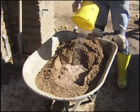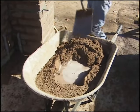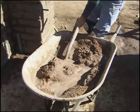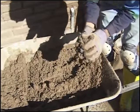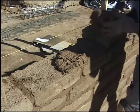The mortar used for the adobe wall is made out of mud itself, just like the adobe block. It was purchased as a dry mix — just the raw earth material that the adobes were made out of at the adobe yard. It was delivered by a dump truck, and then all you do is add water to it. As you can see, you keep it a very thick mix. This is so that as you stack the adobes up, the mud does not ooze out the side.